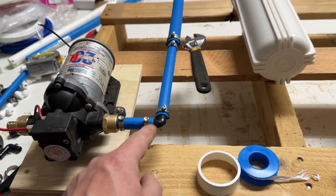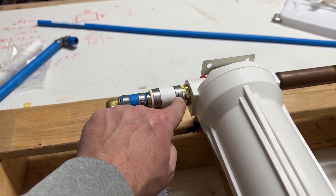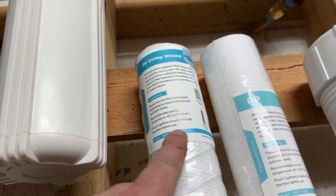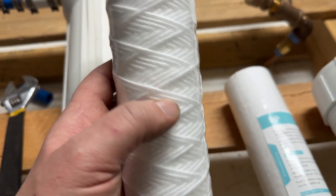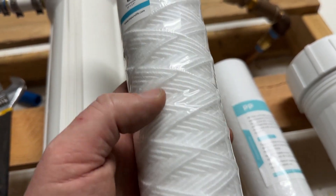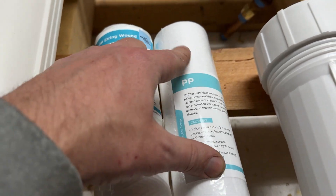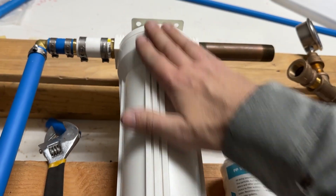I've got conversion to half-inch PEX, going up to three-quarter-inch PEX, up to one-inch PEX, and then a three-quarter-by-one-inch adapter to our first housing, which is a sediment filter. This is a SimPure sediment filter and a Membrane Solutions membrane — a string wound filter. It's going to force liquid through and catch debris, bugs, sticks, spiders, ants, twigs, and pieces of dirt — all the big stuff. This is a pre-filter with a five-micron rating. Both filters are five-micron: one is wound string and one is more like a fabric. They're all food-grade polypropylene filters.